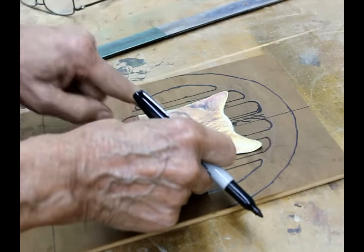All right, next thing we have to do, we have to epoxy this shaft onto the tuning condenser. We'll use some JB Quick for that, so it'll be quick. You just need a little itty bitty drop of it here. A little more. There we go. Now we'll just let that sit there for a while and harden, and then we'll be ready to screw the radio onto the front.